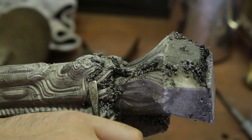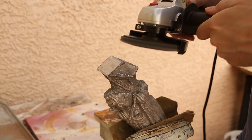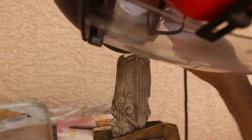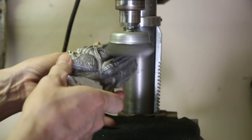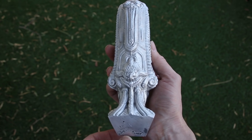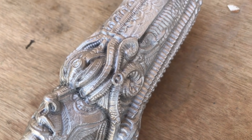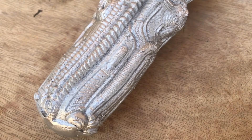Then I cut off the vent and used an angle grinder to clean up the casting. The last step was to shine it up with a wire wheel and the casting was finished. I think this turned out great considering that I made it using materials that can be purchased for about $40. If I did it over again, I would coat the entire shell with joint compound and use a larger riser on the head to supply the casting with metal as it solidifies and shrinks.